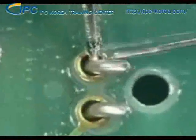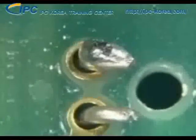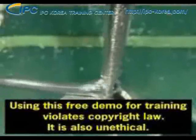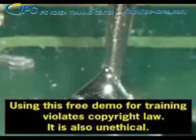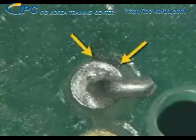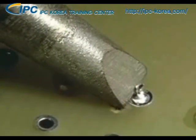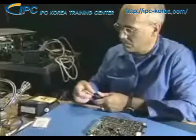Having the wrong tip size on your soldering iron can cause other problems. If the tip is too small, there may be incomplete solder flow or a cold solder joint. Too small a tip will also increase the dwell time — the time the soldering iron is in contact with a connection. Increased dwell time is due to poor heat transfer, which happens when you use a conical tip on a large surface area, and can lead to component, conductor, or circuit board damage. If the tip is too large, it can overhang the connection area and cause thermal damage to the circuit board substrate. These are the reasons why tip selection is such a critical issue in the hand soldering process.